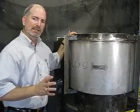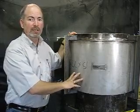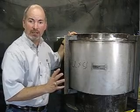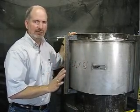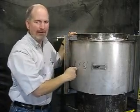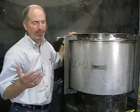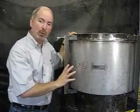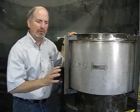So you've decided to replace some or all of these expansion joints. You want to go back in with a heavier cover. A lot of the originals from 25 or 30 years ago had covers that were really thin — sixteenth of an inch, 16 gauge. We've seen missing covers and cracks all over these things down in the LP turbine. Go with a minimum of an eighth of an inch thick — three-sixteenths or quarter inch is not bad at all — with a liner on the inside and heavy covers on the outside. That protects the bellows from resonating against high flow, which is one of the few catastrophic failure modes. A cover that isn't thick enough will get dislodged, and in short order the bellows will vibrate itself to death.